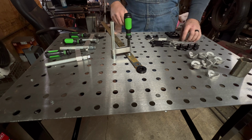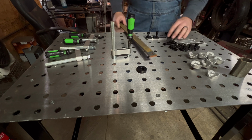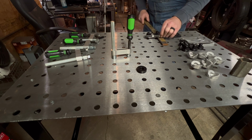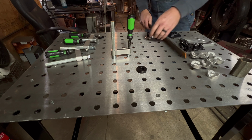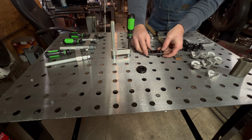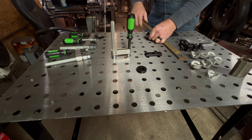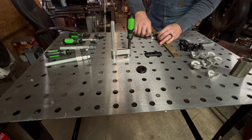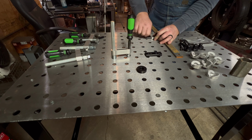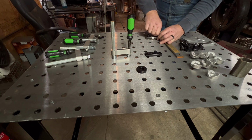And then if you wanted to, you got another option, which is these blocks over here. Take this off. These clamping blocks. And so that's set up to where you could do it like this. There are these magnetic blocks below. So you just put those up underneath, and it fits right in those 2 holes. These bolts go right through. Let's see if I can get this one to clamp down. So again, obviously you'd want to have a set of wrenches handy, and maybe an Allen wrench specifically for this table. Okay, so that secures that down.